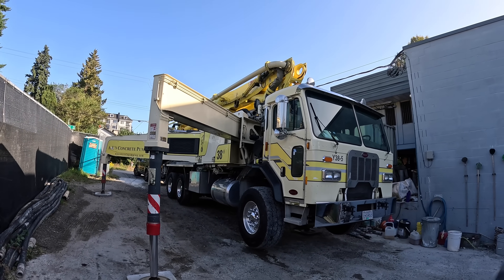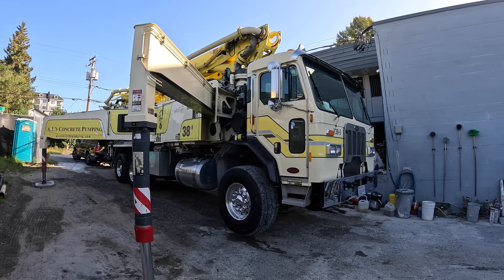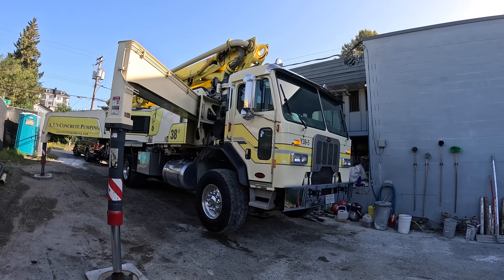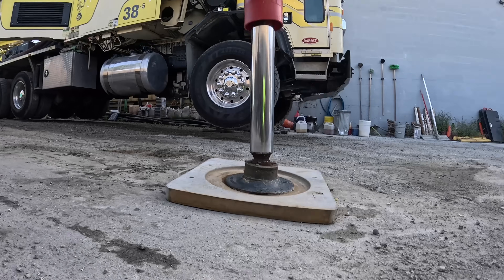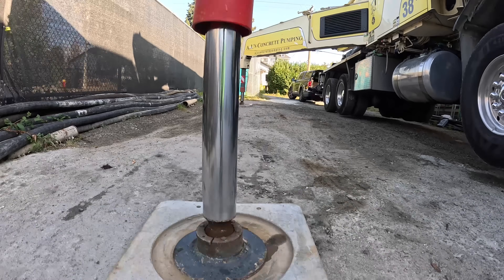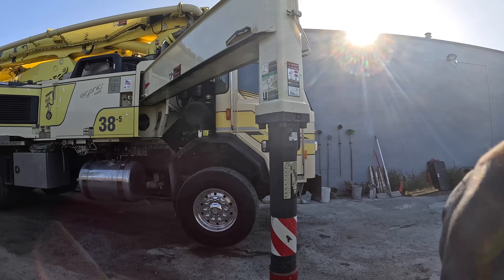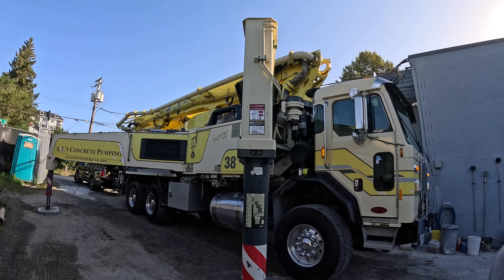What it is, what it does — in a scenario like this where you're set up, and those of you that work in areas with a lot of terrain can relate to this: you set up on a hard surface like an asphalt or concrete roadway, or just some really, really hard ground, and you end up with the swivel foot on the outrigger like this, which is not ideal. It puts a lot of load, a lot of side load on the outrigger — a lot of force in directions which you don't want.